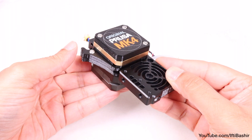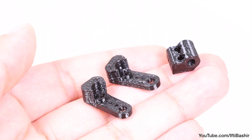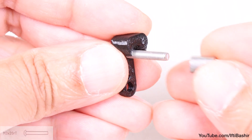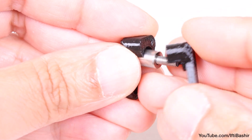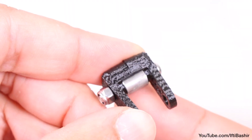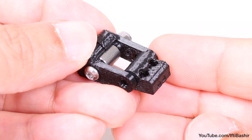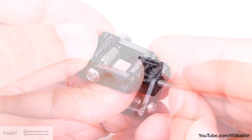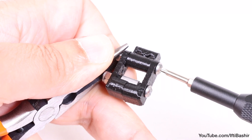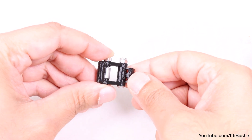The extruder is really starting to take shape nicely now, and it's on to building up more of the idler swivel door that'll attach to the side of the extruder. With these three pieces to hand, begin with a side section and feed through a single M3 by 20 screw on the larger end. Drop on a spacer before going through the opposite end and securing into place with a single M3 nylon lock nut. Hold the nut and tighten the screw just lightly — the spacer must rotate freely, so do not crank down too far on the screw. On to the opposite end now, where we insert the idler nut into the assembly in this orientation. Take special note to ensure orientation is correct before inserting a single M3 by 20 screw through the parts, and again secure with an M3 lock nut while you tighten the screw. The idler nut we inserted into the middle must be able to move freely, just like the spacer on the other end.